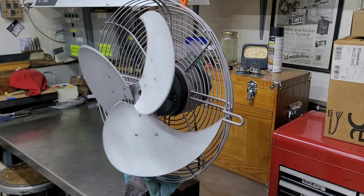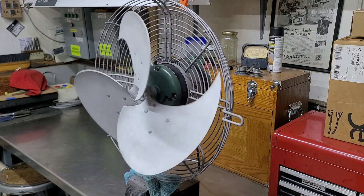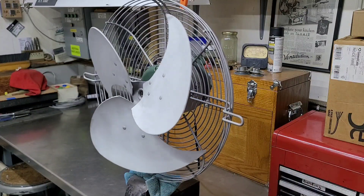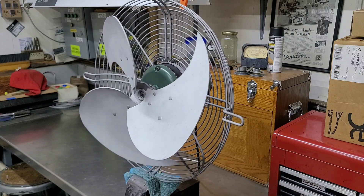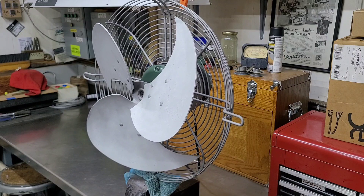This one has the totally enclosed type motor, which is another reason I'm going to be using this in the wood shop environment. I feel like that will be excellent for keeping the motor clean and not getting full of sawdust. Even though the standard ones have a self-cooling design where they pull in air from the vent tube to prevent that, you still get some blow-by with very heavily dusty air, and it can get sucked back into the motor.